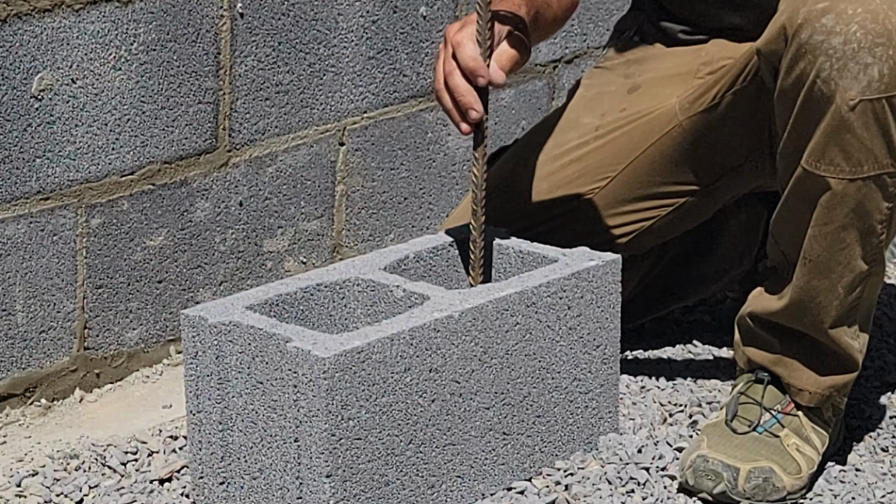Now that we have the walls in and we're bringing the drain tile around the inside, I'm running the portable generator again to run the sump pump that's in the basin to get the water out of here. We had covered the inlets with hardware cloth to keep gravel from getting into the basin. Now I need to expose that, take off the hardware cloth to connect our drain pipe. I'm going to connect the drain pipe from this end.